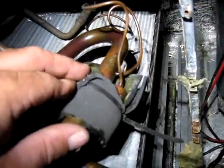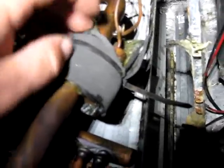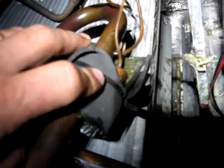The leak in the coil — while we're changing the TXV — this is the sensing bulb tube here, sensing bulb's underneath here. This is the equalizing tube for the TXV. They came together and rubbed and actually sawed each other. There's a tiny hole on the equalizing tube. If we would have cut the sensing bulb tube, we would have had a different set of symptoms. But because it cut the equalizing tube, the refrigerant just leaked out of the machine. So that's why we're changing this TXV.